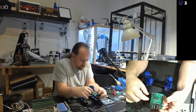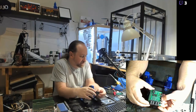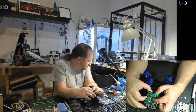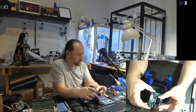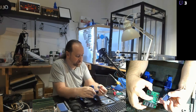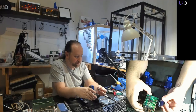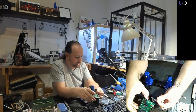So unfortunately the level shifters I got are the wrong type of level shifter. They're wider and the pinout is a little bit different. So I need to order some more of those, and I've got a couple of extra little components to plug in. And there's also a small OLED screen that goes in. I'm going to solder a little connector socket on the board, so I can run the cable out with the OLED screen to the front of the 3D printed case, so you can actually see it and it looks nice.